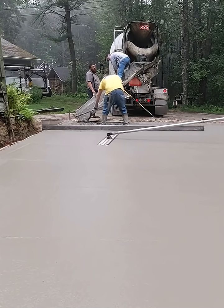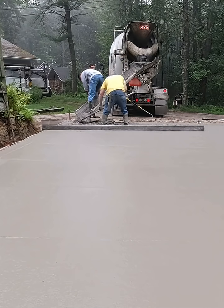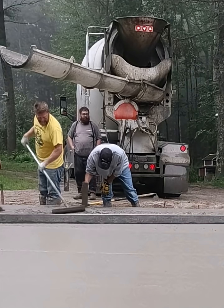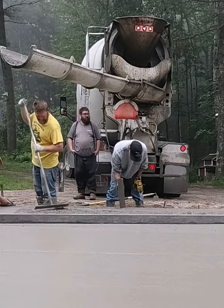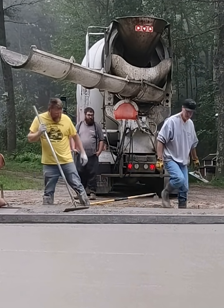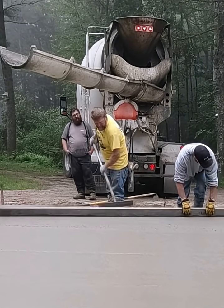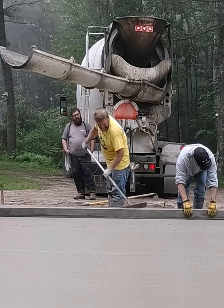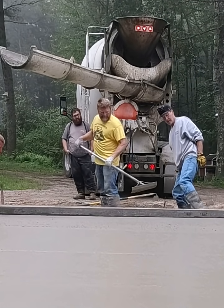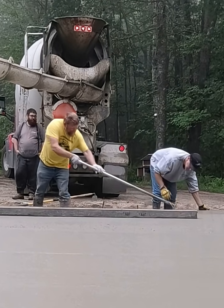The homeowner wants us to stick some rebar upright in the blocks. We cut pieces about 16 inches long — number four rebar, that's half-inch rebar — and we're just going to slide them in the edges. A concrete block is eight inches wide by about 16 inches long. He pre-measured areas every four feet or so and made a mark on the form where he wants us to stick those pieces of rebar.